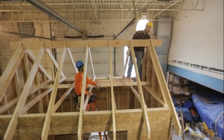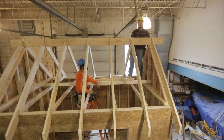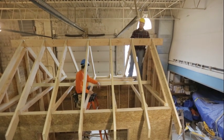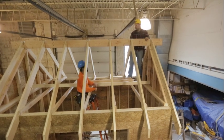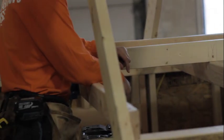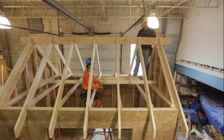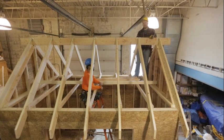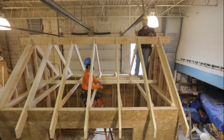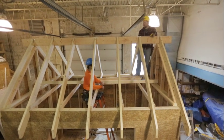We've completely finished our gable and framing, put the wall sheathing on the outside, and we're ready to brace our roof. Azad has already put a two-by-four running the length of the building, which is going to stiffen our ceiling joists. Before we put this in place, our ceiling joists were wobbling back and forth — this keeps them right where they need to go.